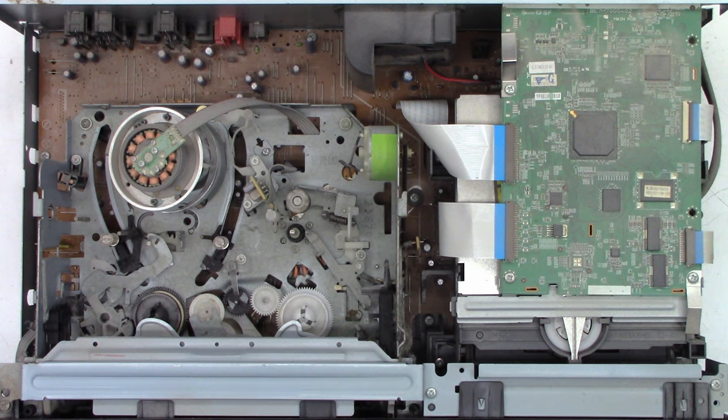Let's just go ahead and power this thing up before I do anything, because I don't want to spin it and blow a piece of fuzz out of it. That might be the whole problem. Okay, here we go. AC power has been applied. And the fan does run, and it is fairly quiet. I have dashes in the display, which means the power supply capacitor is good.